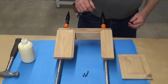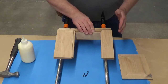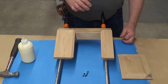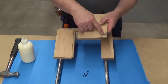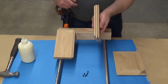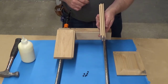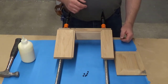The first thing we need to do is get it all laid out — you've got your two clamps, your stiles face to face, your top and bottom rails in the right-hand orientation. I've got my panel handy here and before we do any gluing, you've got to make sure that your panel is sanded just around the curve or the coves on the front, and make sure that the two sharp corners at the top of the opening are also broken and eased. Just use a piece of sandpaper or an old sanding disc to take care of that.